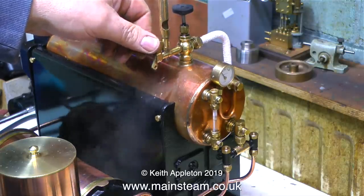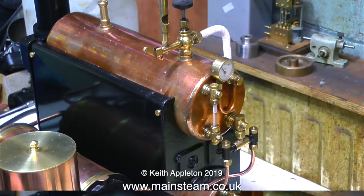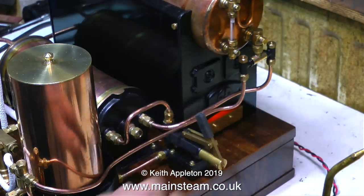There's nothing on the clock but the steam's coming — as you can see when I press the whistle valve it makes a bit of a whistly sort of a noise, so all I need to do now is let the pressure build. In this clip I'm testing the hand pump, although I will be using the injector for topping up the boiler, not the hand pump.